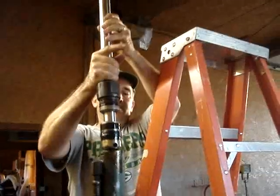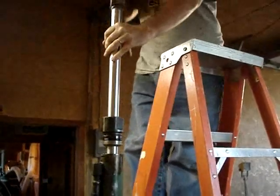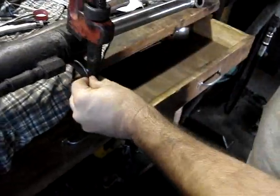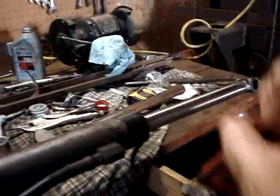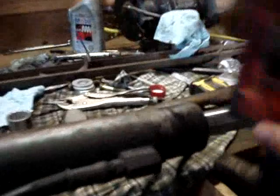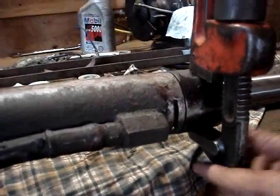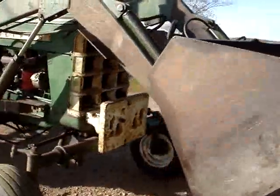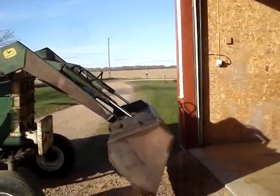Now you're going to want to oil up these seals real good and get some inside your cylinder. It goes in through the hole and then it turns into it — from the hole side like that. Turn it until that clip is all the way in, then turn it slightly past and turn it back.